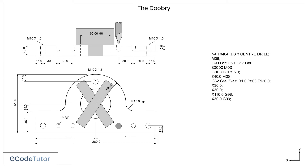For our next hole position, we don't wish the machine to retract that far from the component. There are no obstacles in place, so a retraction of 1mm above the component is plenty. We do that by adding a G99 code. Now the machine will read the R value from the cycle line and not the Z value from above it. So the line X30 G99 moves the drill to the next position and automatically drills the hole, while only retracting 1mm because of the G99.